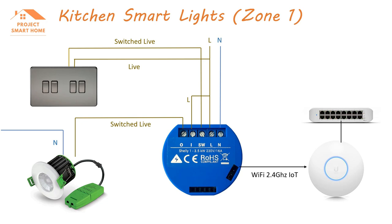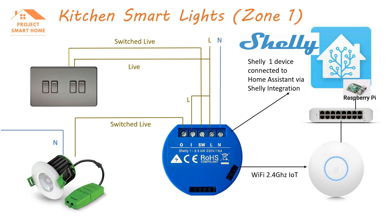Once wired up and connected, the Shelly advertises itself to be connected to your Wi-Fi network. My Wi-Fi network is from Unifi - I've got a dedicated 2.4 GHz IoT network which I've connected my smart relay to, which is connected to a Power over Ethernet switch port. Home Assistant is on the same network. Once your smart relay has an IP address, you go into Home Assistant, add the Shelly integration, and then add your Shelly device by entering its IP address - it's really straightforward.